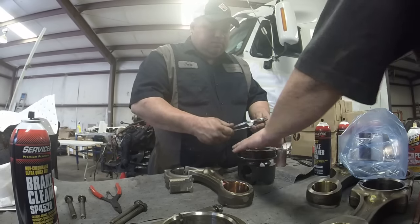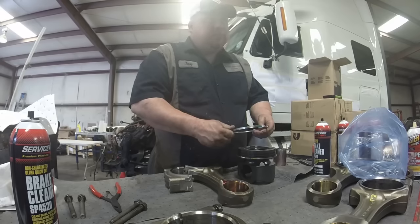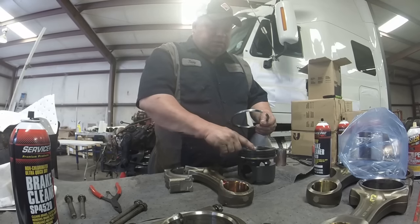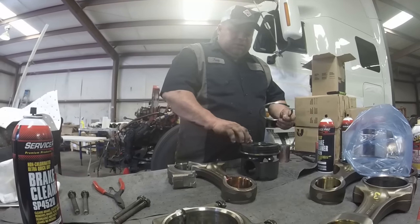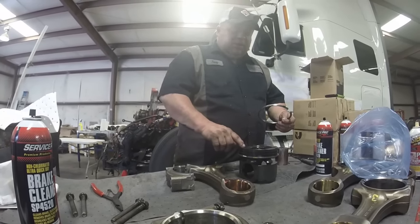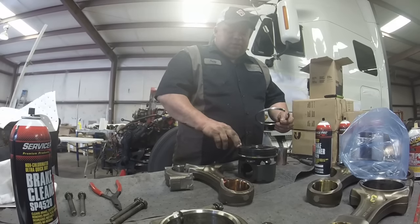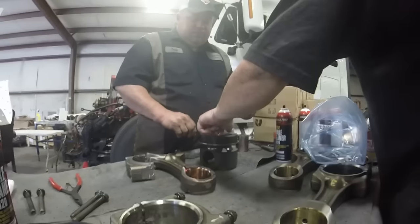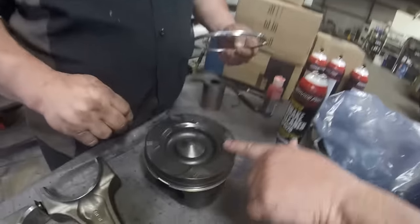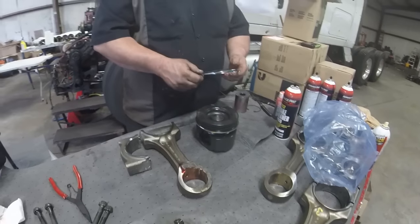Like these are composite pistons that are coated. You'll get some non-composite pistons and wonder what happens after 300,000 miles when they look like the craters of the moon. The aftermarket won't have the markings, so you've got to determine which groove is lower than the others — the others are thicker than that. That's always the exhaust side — that's the exhaust groove. So these three are the same height and that one's actually lower. You can feel it. These three grooves are the same height, and then that one's significantly lower for the exhaust valves. That's a good part about getting genuine Cummins — they really do a good job of marking their stuff.